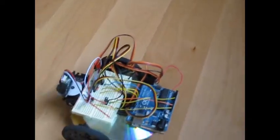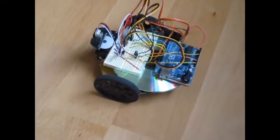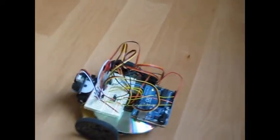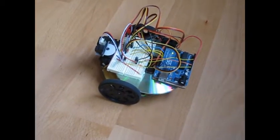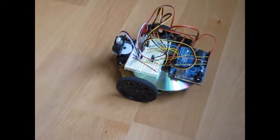I added a switch to that battery as well, so I didn't have to plug it in to turn it on, so it's much less crude now. I also added this transistor right here, so that when the battery power is not on, it will tie the reset pin to ground so that it's as if someone is constantly pushing reset until motor power is turned on, so it will run through the startup again once you turn on the motors.